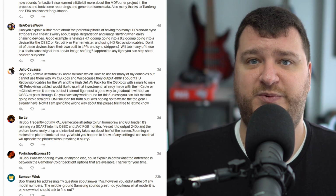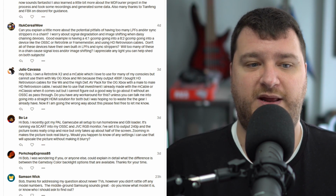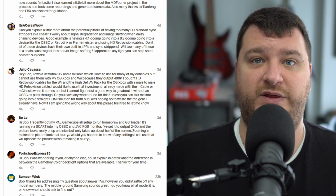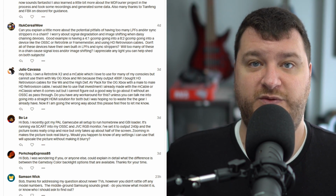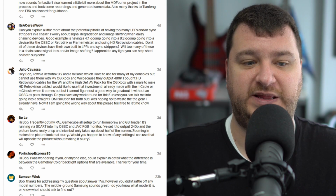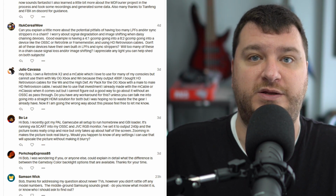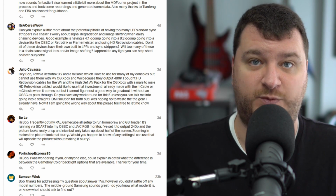So I guess a great example was an N64 mod I was working on, way back when, that had a sync stripper built in because I couldn't figure out what the heck was going on with N64's sync. So I just took it right from Luma, put it into a sync stripper, had the board there, the circuit was built correctly, so it outputted the proper voltage and everything. And to me, that was a perfect solution. And while it's not a bad solution, the better way to do it would be to use the originally generated sync, like Voltar does on his boards.